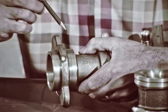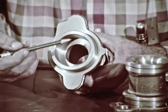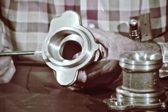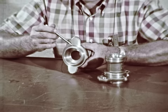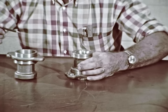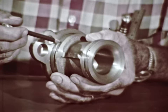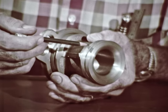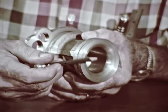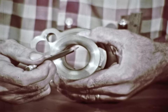The first operation on the spacers is drilling and rough turning the diameters on both sides of the ears. Then the turret machines the front face of the ears, one diameter, the chamfer, and the end of the part. Two more diameters are rough bored, and there is a finish pass over two diameters and two chamfers. In the second operation, the 220 completely profiles the opposite end of the part, forms two grooves, generates the radius, and forms the grind relief to complete the turning. Note the evenness and surface finish of the contoured end — it is machining work like this that endears the 220 to profit-minded men.